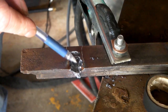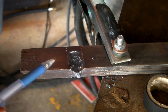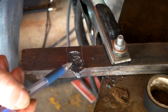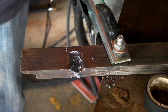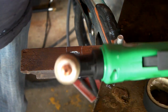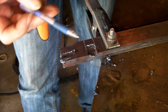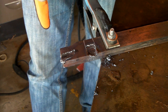See how much that's cut in there — probably about five millimeters deep, and this is half-inch thick plate. You can just carve it out, carve a notch, put some wires in there — useful if you're running wiring along the structure of a trailer for example. It definitely works. With the normal tip you can't roll the ball of molten metal forward; you need to splay it a little bit like this. That simple hack will do it for you, and it doesn't damage your consumables — look, no damage whatsoever, clean as a whistle. Just remember don't go too big with the drill hole. Subscribe, drop me a like and a comment — Pete's always glad to say hi. Thanks for watching, see you next week!